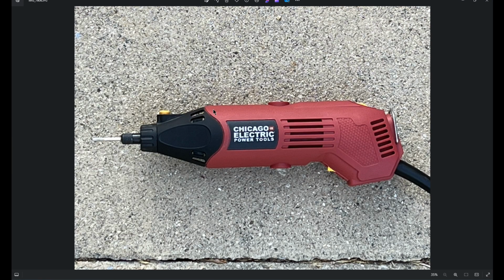I noticed that this tapers ever so slightly by 1 millimeter. So from here to here, it's 1 millimeter thicker than from here to here. I'm not going to go past these cylinders here because there are some vents and I don't want to cover those vents. And I really don't feel like having some sort of bar up to here is going to really change much. So I'm going to just create the holder from this point on to this point on, and that should be enough for the grip.